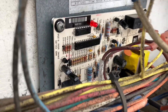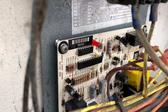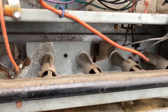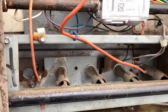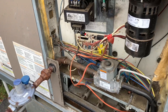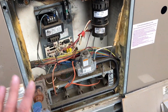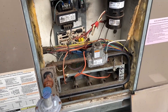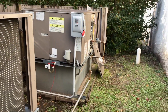Got a heartbeat signal — so far so good. Hasn't tripped any alarms yet. Beautiful — it's lit! Looks like that's one less inducer motor we're gonna have to swap out. It doesn't always happen like that, but today it did. We've still got three more to go, so I'm gonna put this back together and onto the next.